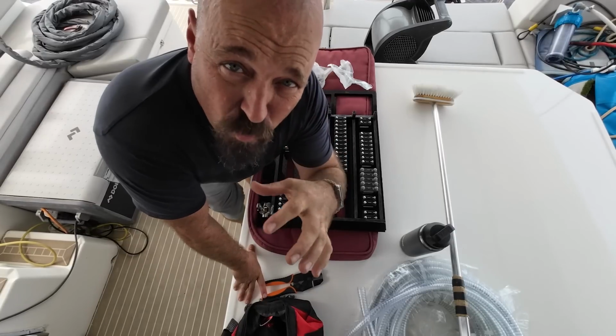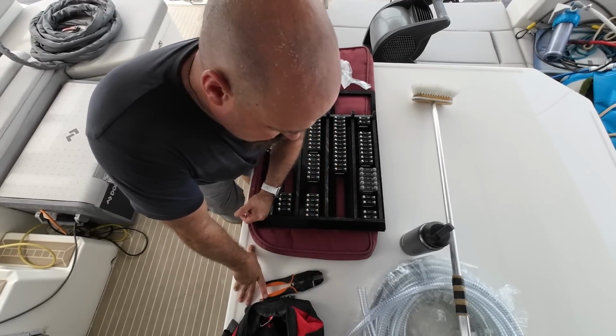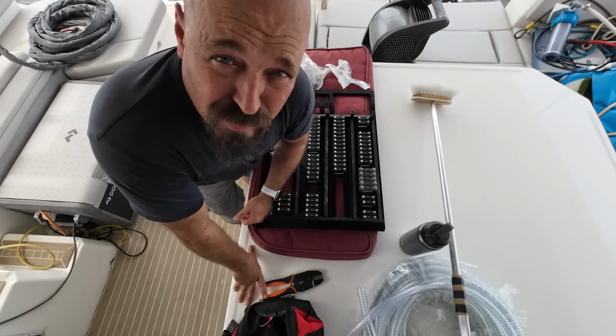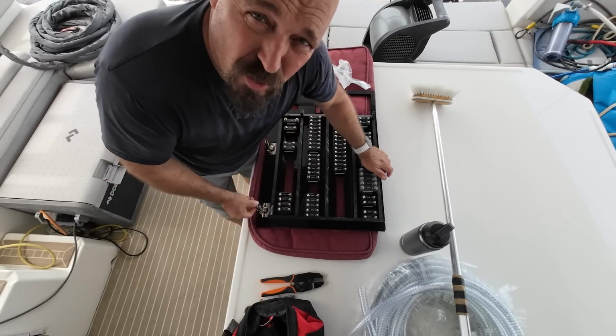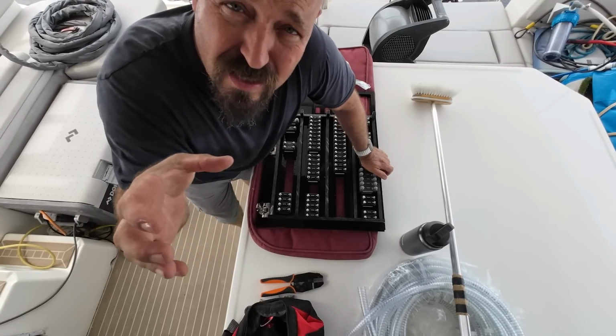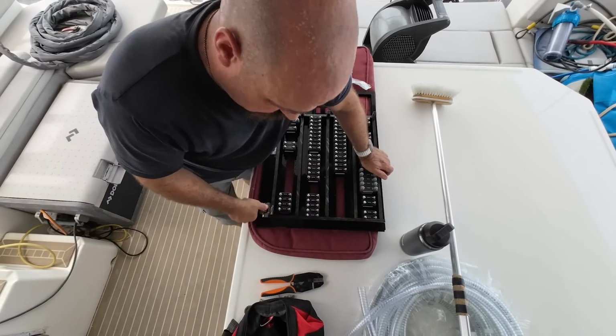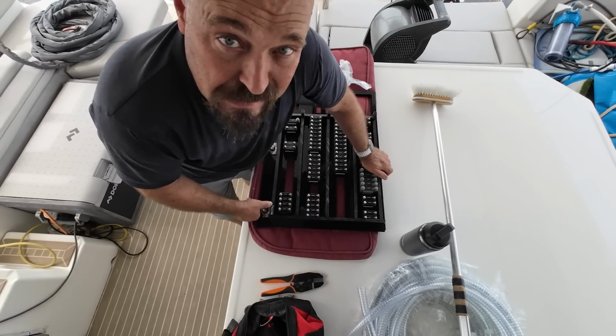Okay, I'm going to take measurements of where the hinge plates are going to go, the base plates inside the cabinet, and then transfer those over, screw those plates in, and then these guys are actually quick release. There's just a grab on the edge, so when you get the hinge close, you hook the front side and the back side just rolls and snaps in with a quick release on it. So hopefully it should be pretty easy.